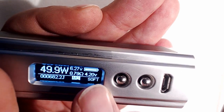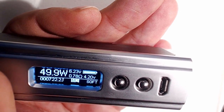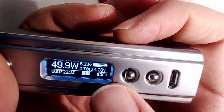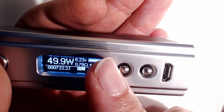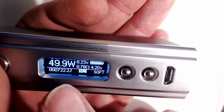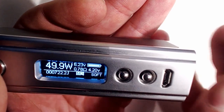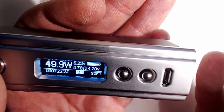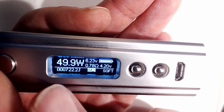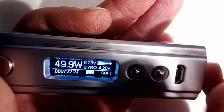There's real-time battery monitoring on here, which is a good thing. If your battery can't cope with the load it will put a line through the battery icon and say 'check your battery.' That's different from the 'battery low' message, which simply means you need to recharge or replace. 'Check battery' means the battery genuinely can't handle the load due to your coil ohmage — a nice little safety feature.